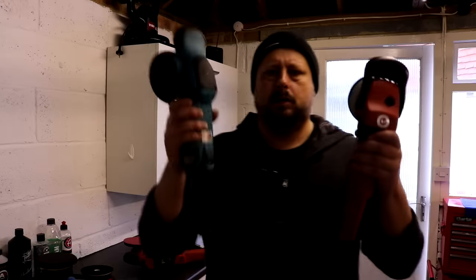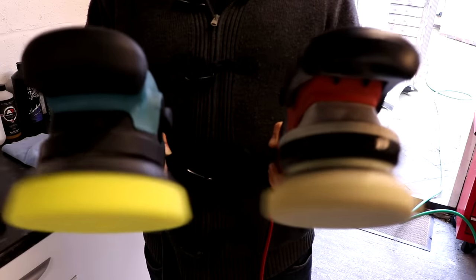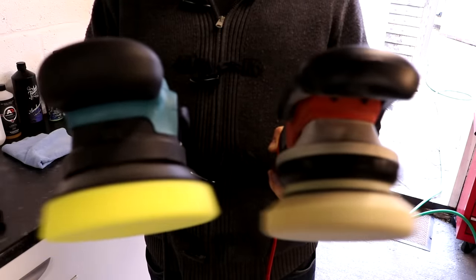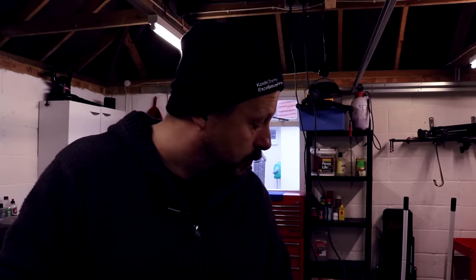It makes sense because the offset on the Makita is smaller — they're mounted on a bearing off-centre, and the Makita has a smaller offset so there's less of that scrubbing action. It has a slightly higher speed, so there's more spin but less scrub. The Flex with its 8mm offset is doing a little bit more scrubbing, and I think you can feel the vibration from that. The Makita also has rubberized handles over the bail. Overall it is slightly smoother than the Flex vibration-wise, but there's not a lot in it.